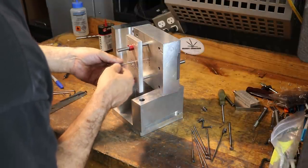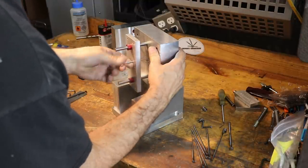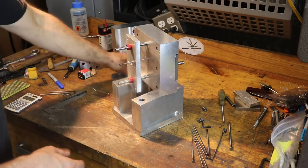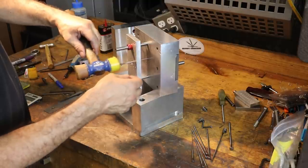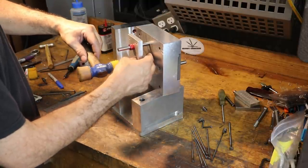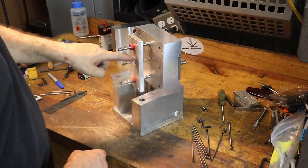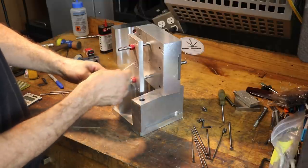And a lot of times I'll account for the thickness of the pin itself, like with a pocket back here. I may still do that, but again, I'm running out of time. So we may just rely on sandwiching the, well, we also already cut the pins to length. So the only thing I can do is pocket this side. But the idea is to make a little pocket for this head.